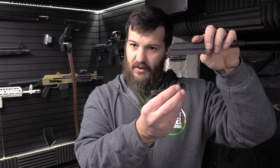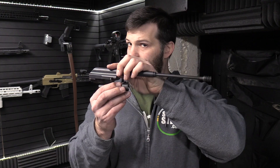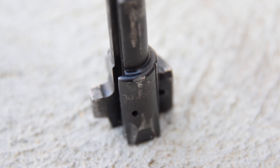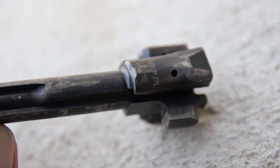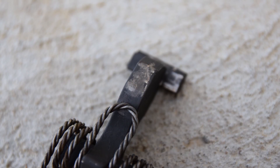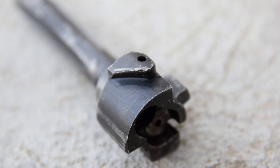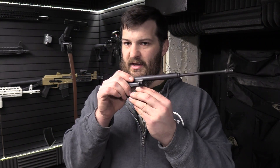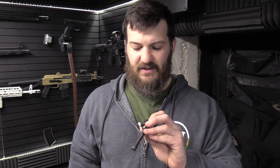There is a little bit of polishing of finish at the front of the bolt where it picks up ammunition — that is to be expected. The forward camming surface on the bolt looks fine. To understand what that means: the carrier runs to the back, drags the bolt and rotates it, and then as it returns into spring tension it flings forward and smacks into the bolt in the channel — and that looks fine. However, there are a couple of areas on the bolt that are a little concerning. There is a divot at the neck — I'm not sure what is causing that, it could be interacting with the ammunition or with the hard part of the hammer — and it is taking a decent chunk out of the thing. Additionally, there is a small chip out of the rearward camming surface. When the cartridge fires, the carrier slingshots to the rear and smacks into the bolt, camming it over, rotating it, and pulling it to the rear — and that surface has got a small chip out of it.